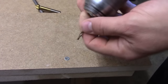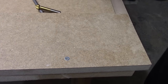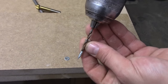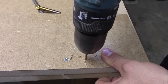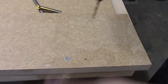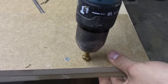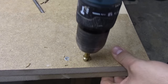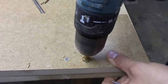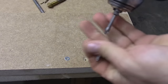So let's do it again. First you drill a little hole, smaller than the size of the screw. Then you use the countersink bit. Checking if this is enough — maybe a little bit more. Now you can drill your screw.